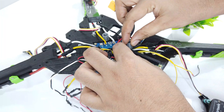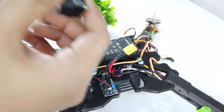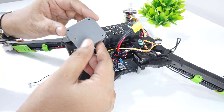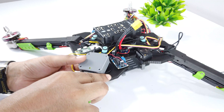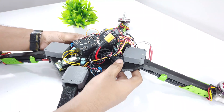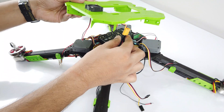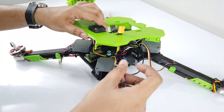To mount the Pixhawk, I am using 3D printed washers to increase its height. This TF Mini rangefinder helps in maintaining the perfect altitude. These are the arm mounts which help in folding the arm. I have mounted all of them and attached screws from the bottom side. I have also mounted a 3010 fan for cooling the Raspberry Pi, as it heats up during video transmission.